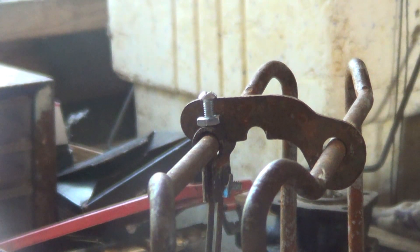Either way, if you don't have the taps and you don't want to get them, just go ahead and drill a bigger hole than the number 29 bit and weld your nut on top and you'll have an adjustable trigger.